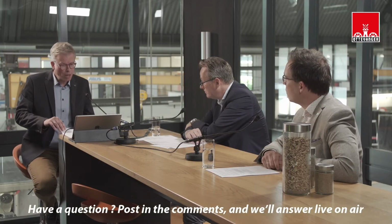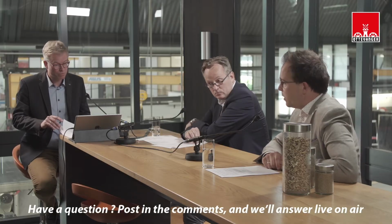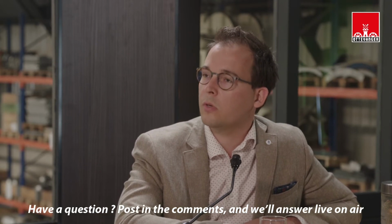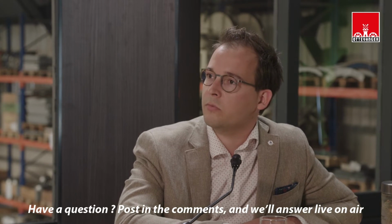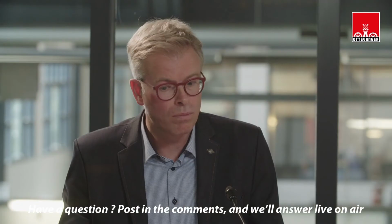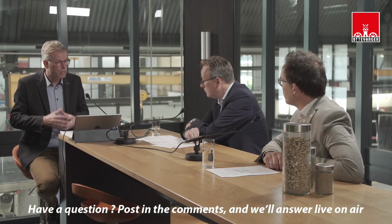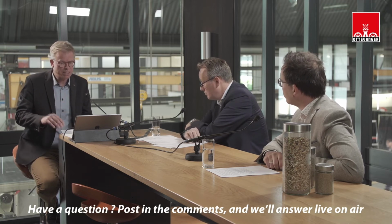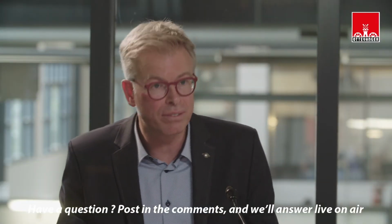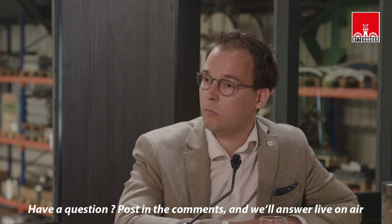What is the maximum number of categories which can be created? At the moment, we're working with 7 categories. So the 5 sieve fractions, we have the top 10% of the biggest kernels, and we have the average kernel size, 7 fractions in fact. But this can be expanded, because the GrainCam has in fact an infinite range. And a related question to your answer: can it be used to equate to 8 sieves rather than 4 or 5 sieves? Yes, I think that's definitely possible. Good. Next question.